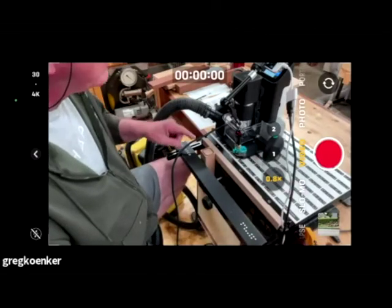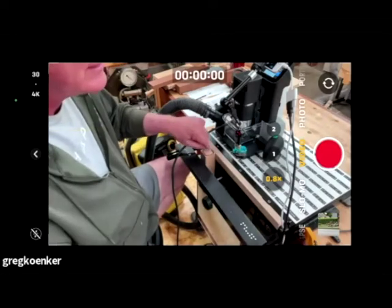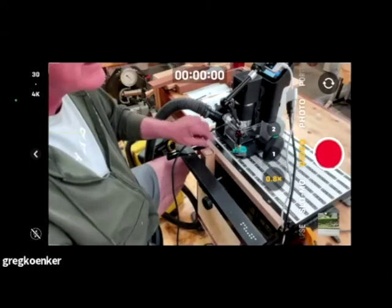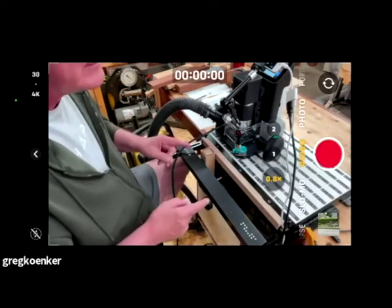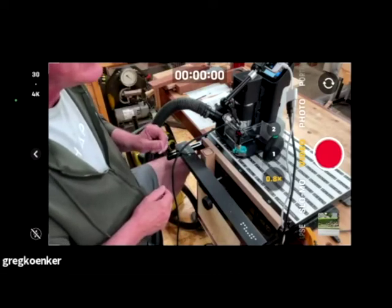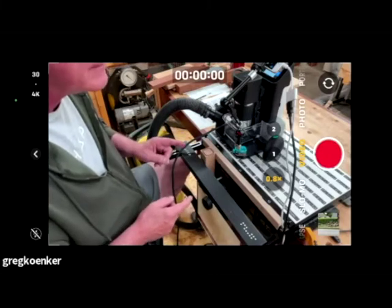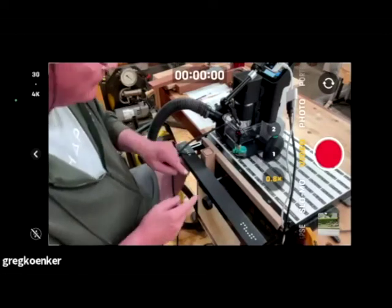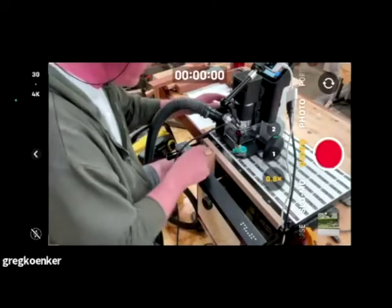So I'll go ahead, rather than knock this outside part down, I'm going to do a second pass at a 1/2 inch depth. So what I've already cut, I'll cut another 1/4 inch deeper to final depth in this case. Then I won't even bother shutting it off. I'll put in a 0.2 inch offset and clean up this outside here. Okay, so I'll do that, and then we should have that part finished.